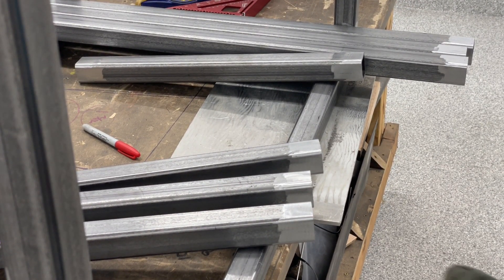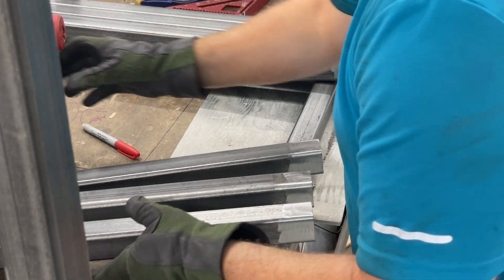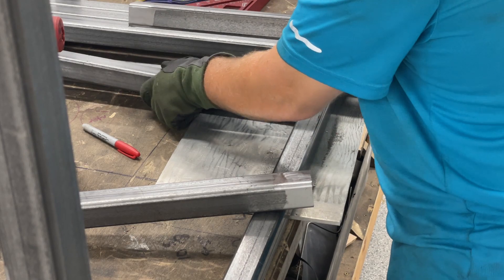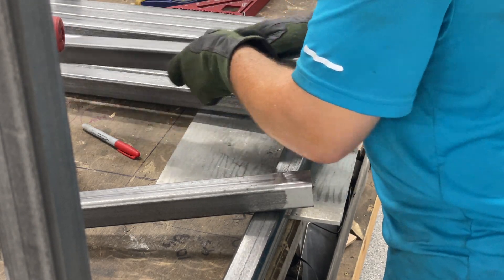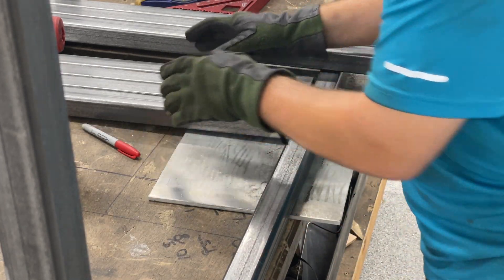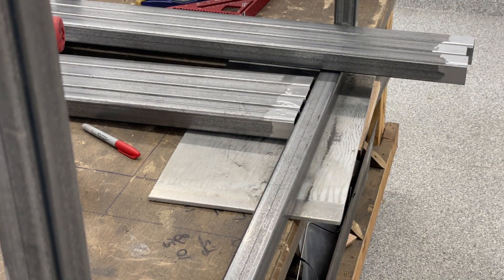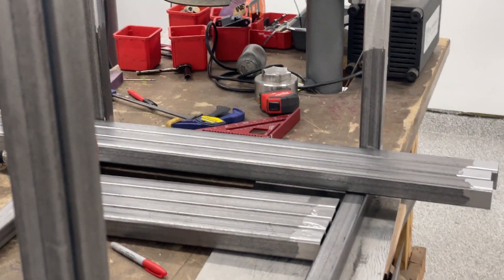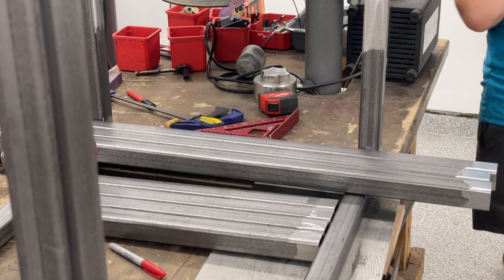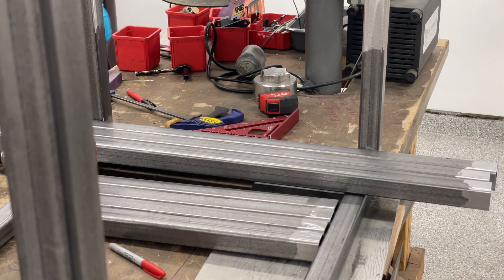Next up is drilling holes into these so they do not outgas. You drill into steel to prevent it from outgassing while welding. That outgas causes a lot of porosity — it ruptures a hole and makes it a pain in the butt to work with. So let's just drill some holes.